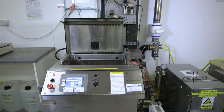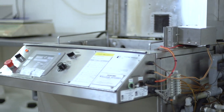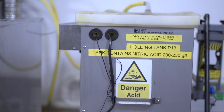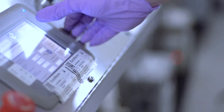The William Hughes passivation plant offers novel functionality in that there is no manual dunking of component baskets from station to station. Instead, the plant performs fluid transfer, moving chemical solutions from holding tanks into the main processing unit as required. This prevents damage to the parts involved as they are not required to move.